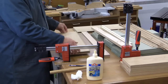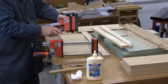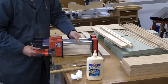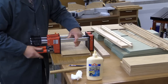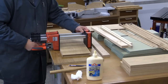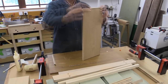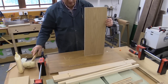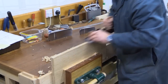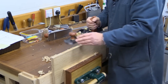Once you've got the two opposing long faces done, I go along with a pair of clamps like this. The idea is to work my way along the length just to get it squished up — that helps the glue to really suck in there nice and tight. Once it's sitting loosely in place, we can do the final clamping up. You will need to clean some of these edges up, so make sure you do it nice and gently.